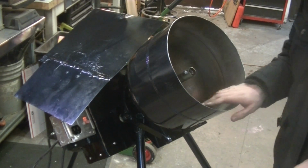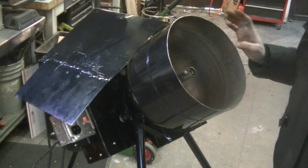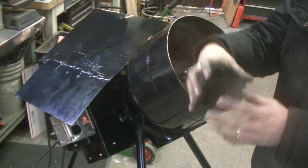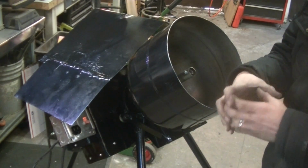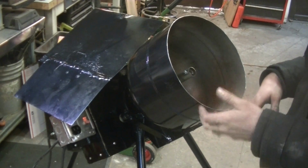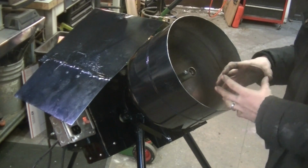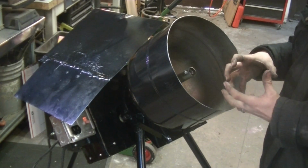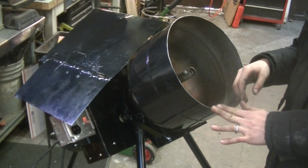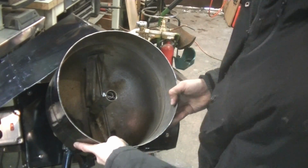One other thing that I found when building this is at first it slipped a lot, and that's because on the reduction, the one pulley that has a big gear with a big pulley with a little pulley attached, I found that that little pulley I made was too small, and there just wasn't enough friction. Because it's wood, right? There wasn't enough friction on the belt to grab it. So I actually had to make that bigger so it could have more pulley to grab without bending so harshly. That helped tremendously in how much strength it has, but it turns a little bit faster than I would like. So let's turn it this way.